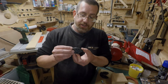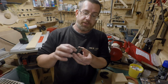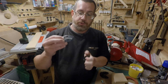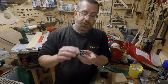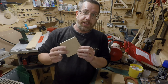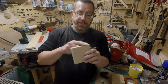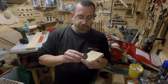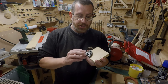With these jaws, you get four jaws like this, and they're held on by two center holes with ordinary bolts onto the chuck, just like all the other jaws. The other four holes let you screw a piece of wood on here. I've got some 18mm MDF left over from another project, and I've cut these all to 100mm square. The idea is to pre-drill four holes in the corners so I can mount it on.